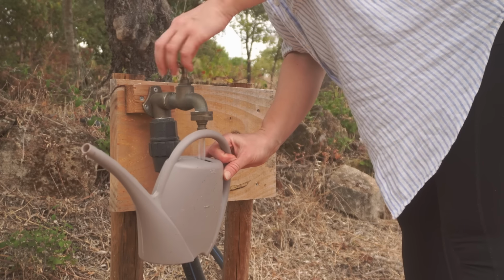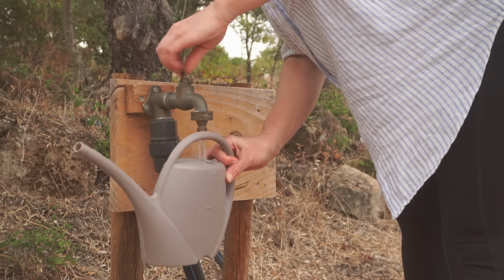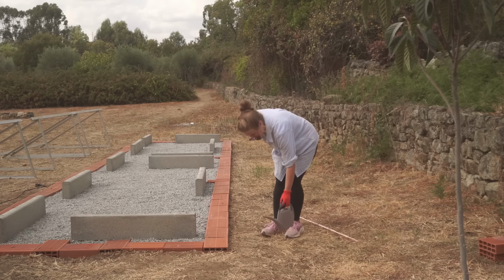When I thought about getting the ground rod into the solid earth, I did think it was going to be really tough just because you're trying to drive it in so deep. However, I found a technique where you just use a tiny amount of water and you just drive it bit by bit in with your hand, not with a lot of force, and just miraculously all the particles just move out of the way for the rod. So that's what I'm going to try. I am a bit sceptical though.